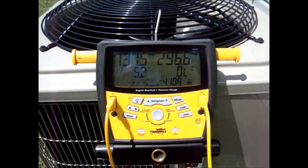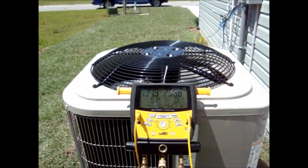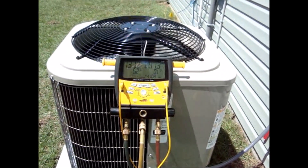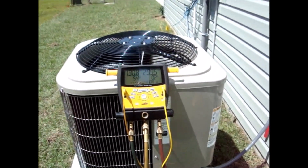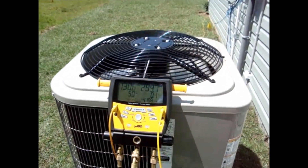As you can see, everything is pretty much the same as when I left it last week — the expansion valve is not closing. I went upstairs, took a look at the valve, made sure the sensing bulb was where it should be mounted, secured everything. Nothing looks unusual, everything looks pretty standard.